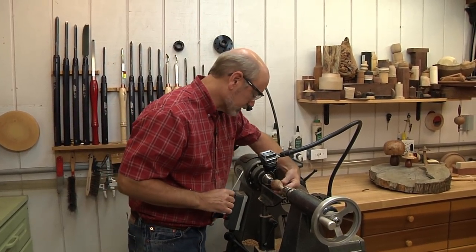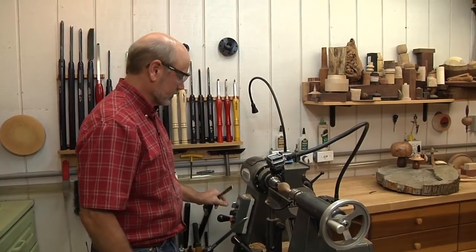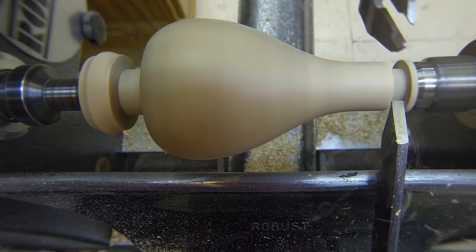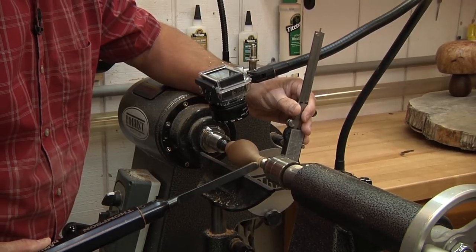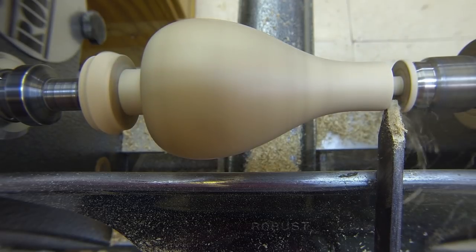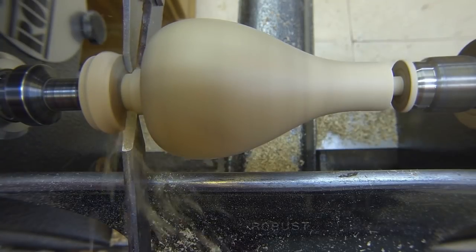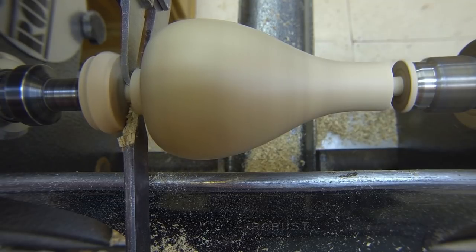We sanded to 400 grit, and now you can see why zebra wood is so pretty — it has very distinct markings on it. We're going to turn this on, pick the speed back up a little bit from the sanding. I've got my caliper set at one quarter inch and we're going to come in here and make our first tenon. I'm making it wide — going further away from the piece — so if I make the tenon too shallow or too skinny I always have a little more room to work with. Come over to this side, going out wide again.